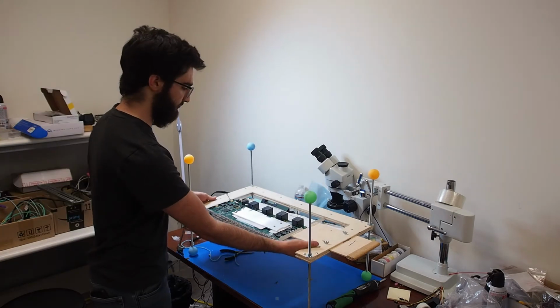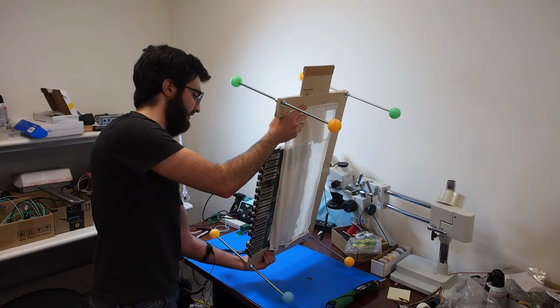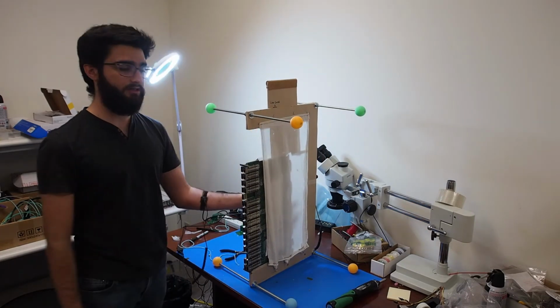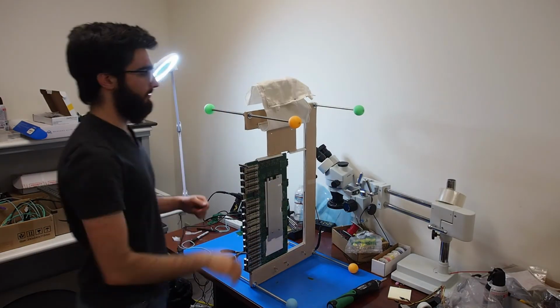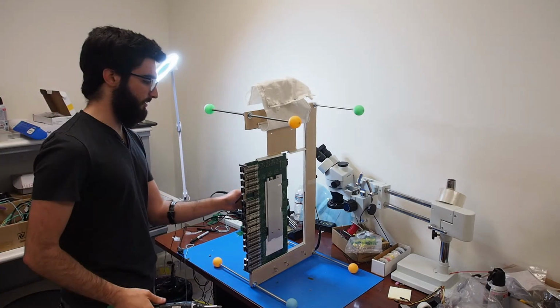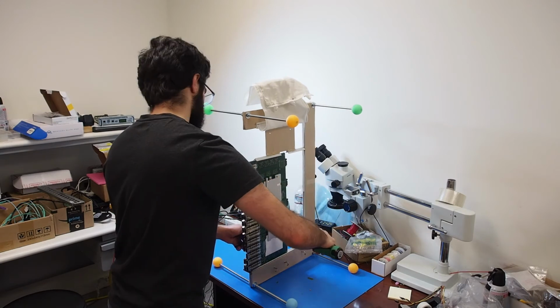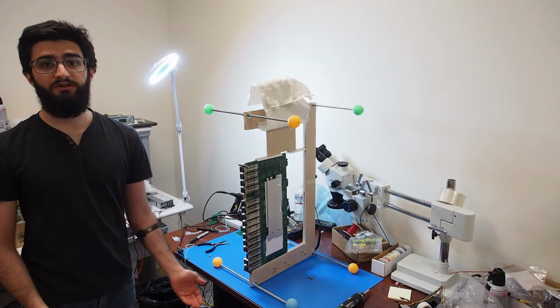That's really easy to do. We can just raise the PCB once more and lift it around and place it vertically like this. And now we have access to both the left side and the right side of the PCB. The rubber sheet can now be removed as the nuts keep the heat sinks together. A torque wrench and pliers are used to secure the heat sinks in place. Okay, so now all the screws are fully torqued down, and the PCB is fully assembled.